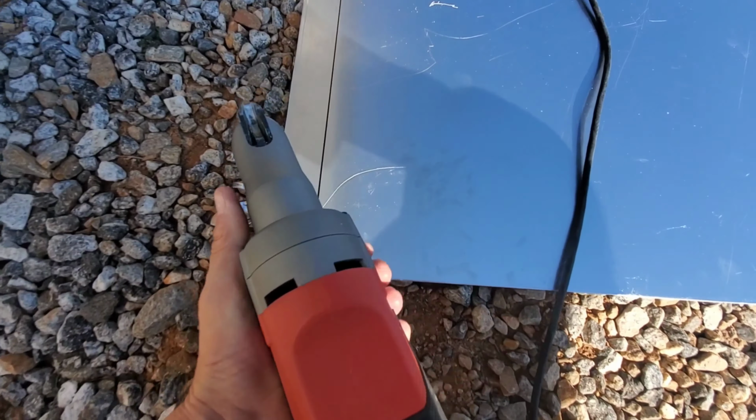And if you could see this drop here, you'll see the permanent marker on the inside of this piece. And that's what it's doing. It's going to cut that. And so it's a lot less forgiving than a circular saw, because if you cut the wrong side of the line, your measurement's going to be off a fat 1/4 inch and it's just not going to work for you. So you've really got to pay attention to how you measure it, where you mark it, and then how you cut it with these.